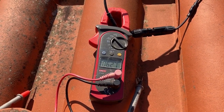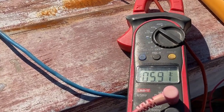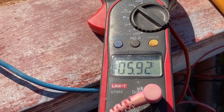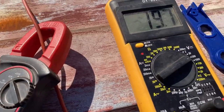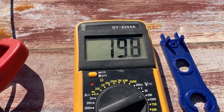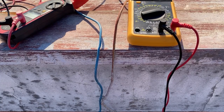Now we perform a real production test measurement in real time to get the voltage and amperage in order to know the real output of this panel in this condition. We get around 5.92 amperes and around 19.7 volts. So we are talking about 116 watts. That's good for this point of winter.